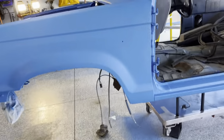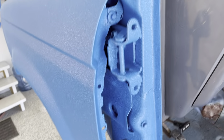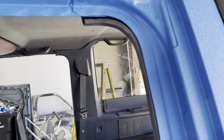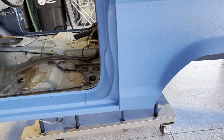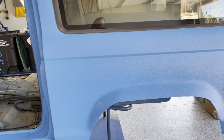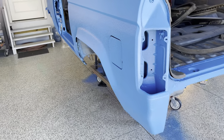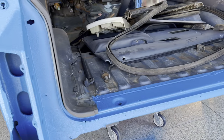Literally I had no screw-ups. I did the door jams — this isn't some kind of quickie thing, I spent a lot of time on it. You can see the texture is really good. I think I could have got it bigger or smaller — you can play with the pressure. If you drop the pressure it's going to shoot bigger blobs, giving more texture. If you crank the pressure way up you're going to get a finer coating.